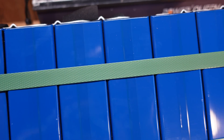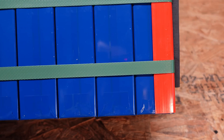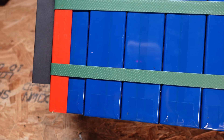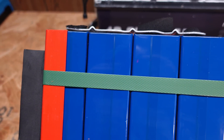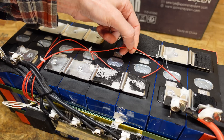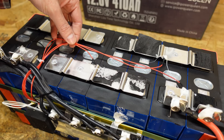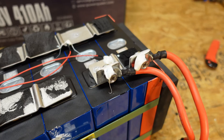The cells are separated with a thin layer of fish paper. All cells are lined up perfectly straight, with no signs of bloating — not even the slightest — so I feel confident these are brand new cells based on how they look and the capacity test results. The battery leads are run with nice quality wire with harder insulation marked AWM, routed up the center fairly nicely, though another zip tie or two might have held them a little better.